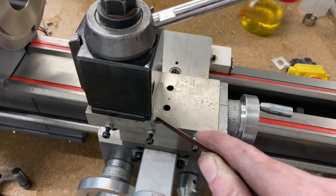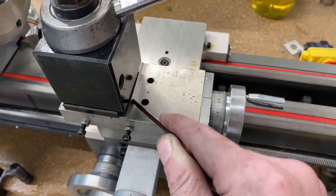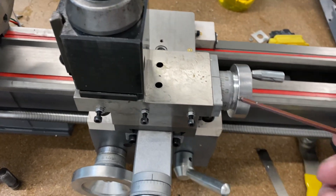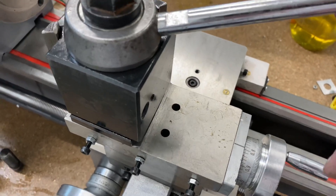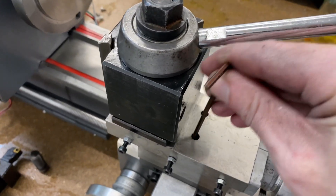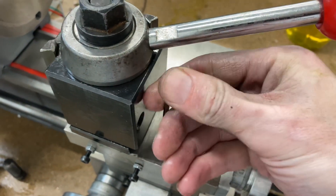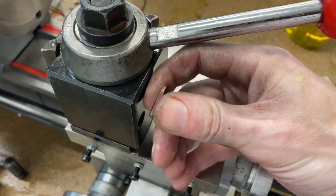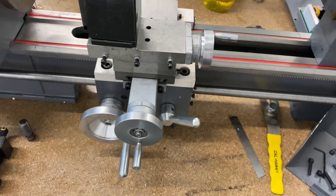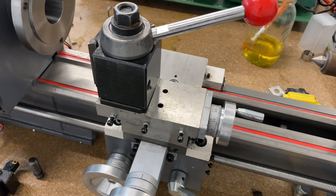The spacing off of the tool post — the little indentation where the tool post rises — isn't super critical, but that's like three-eighths to a half of an inch. What that allows you to do is instead of taking the compound slide all the way off to change the angle, now I can reach those bolts from here and easily loosen or tighten them to change the angle very rapidly without having to unscrew the entire thing. Quick tip on that compound slide — hope that helps.